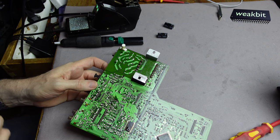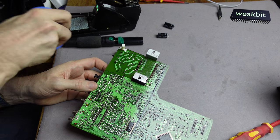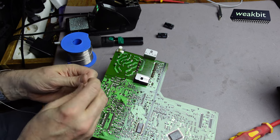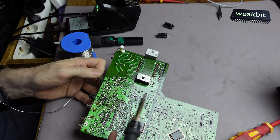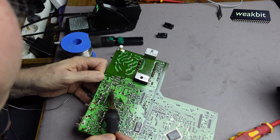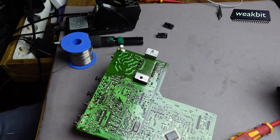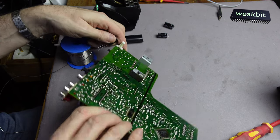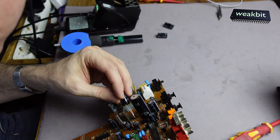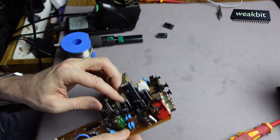But if it explodes, then I'm sorry. I don't measure the volts. If it doesn't explode, then it's okay. Normally you should interchange it with the same voltage or higher, but in this case we say no, we don't do that. Minus and plus, don't interchange this. The capacitor will explode.